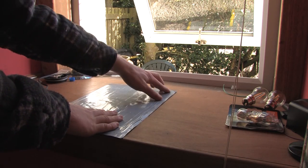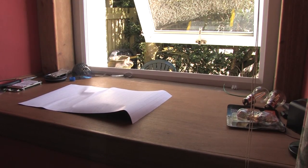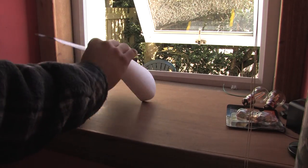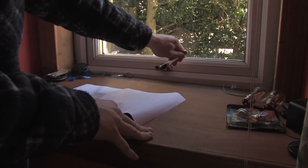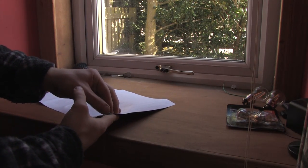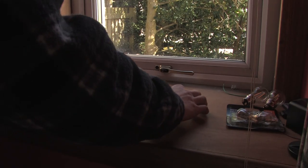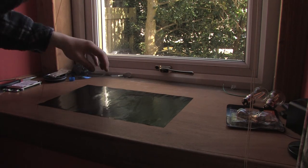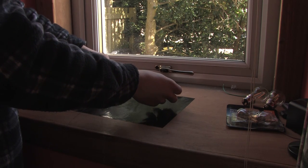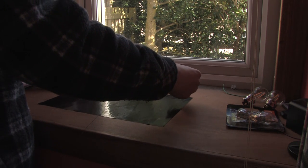This is the exact size I need to make, so I just need to make another one of these. We need to start by laying out some tape upside down. Actually, change of plan — I've got this sticky-back plastic stuff, and I'm going to try sandwiching it between this instead. The backing just comes off like this, and it's sticking to the surface really well — I thought it would all just curl up. Then what we do is just lay the nichrome wire onto this, and we just want to try and get it to stick to the plastic.